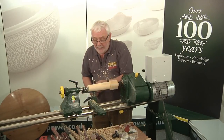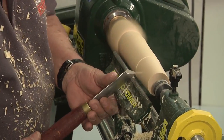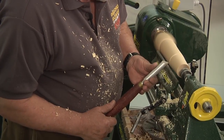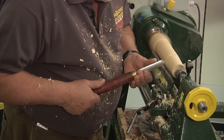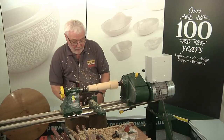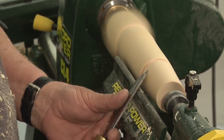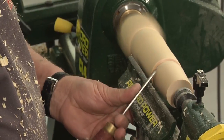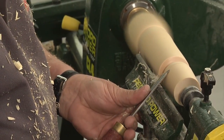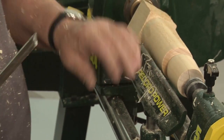A little bit more to move off. So we're going to go again using the skew — we're going to cut across the grain. I'm not pushing the tool. If you watch my right hand, this is coming up and we're going to give ourselves clearance. We're not pushing the tool, we're lifting it. So we drop the skew chisel up — you can see my right hand come all the way up and that's cutting across the grain. You'll see in a second that we're going to get a nice finish. I'm just going to move the tool rest so I can get my finger underneath to support the tool — my finger underneath, my thumb over the top — and we can begin to roll that tool in. And we can roll it all the way around. Just one very light cut to get that good finish, and there you are — you've got a super cut across the end grain.